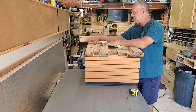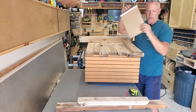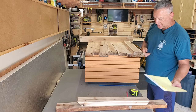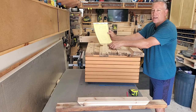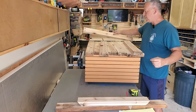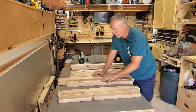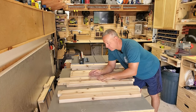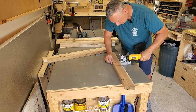So this is all the rest of the wood I have left from the original. I have a couple more pieces over here. So what I want to do is make the top. The top base is 24 and a quarter by 24 and a quarter. I want to make the top an overhang of an inch, so it's going to be 25 and a quarter by 25 and a quarter. And what I would like to do is a breadboard-type end on these things. I am going to use my biscuit joiner to join them all together, but I can only do three boards at a time so I can run them through the planer afterwards, and then I'll have to glue them again.